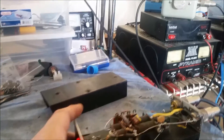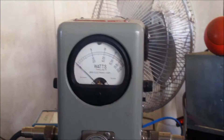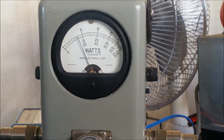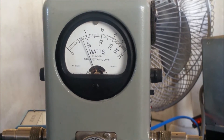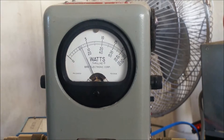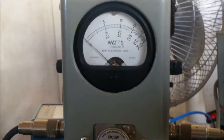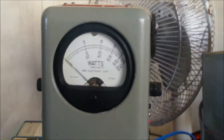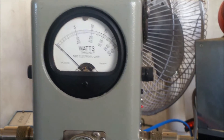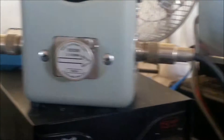This thing wants a little bit more drive, Hobo, so let's give it a little more drive — we're going to hook up the hot radio. All right, we got the hot radio hooked up now. This is a 1000-watt RMS slug. Right there, 160 watts RMS — hitting right there about 140 to 160 RMS. Let's take a look at the peak — close to 280 watts PEP. So I say it's good to go, man.